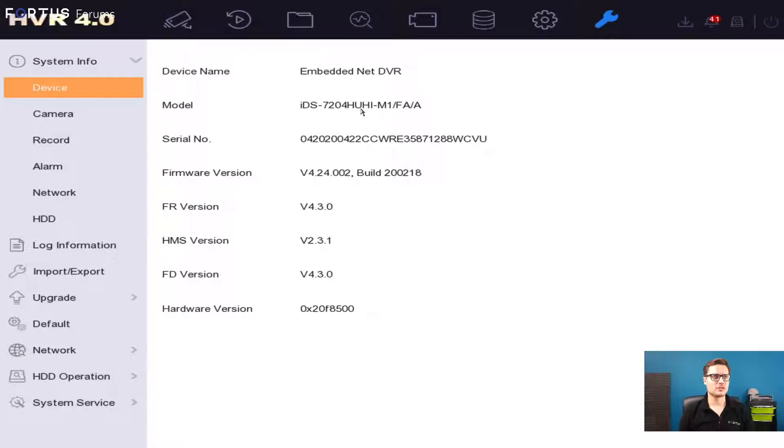In the case when you're using facial recognition, there's also intrusion detection and line crossing in this recorder. You need to choose which feature you would like to use. If you're going to use facial recognition — which is only available for one camera at a time — that will be your dedicated feature. If you want intrusion detection to work on this recorder, that will be just that kind of feature instead. The facial recognition won't be available. So you can choose one or the other.